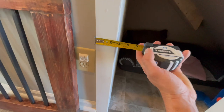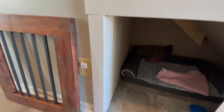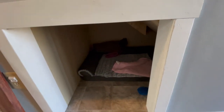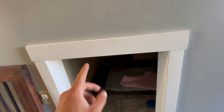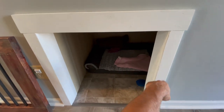And I actually ripped this one down in a saw to make it 2 1/2, because I wanted it to be as thick as possible to mount the hinges and hardware. And I also wanted it flat. So this was actually a piece of trim similar to this that I ripped down. And I still have to go back. I filled some holes. I still need to go back and paint this one last time. But I ripped it down, and then I took a,